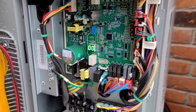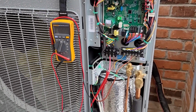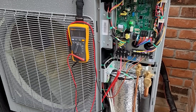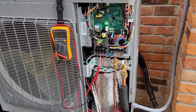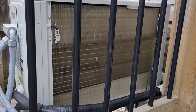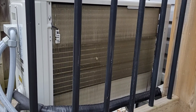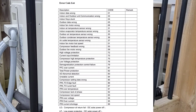Let me know in the comments if you've had any issues with your pan freezing up or ice building up in the bottom. It is a big concern — if it builds up too high it can stop your condenser fan motor and put you into a lockout mode. If you did have enough ice in your pan to block the outdoor fan motor, you would most likely throw a code 58 on the EG4.